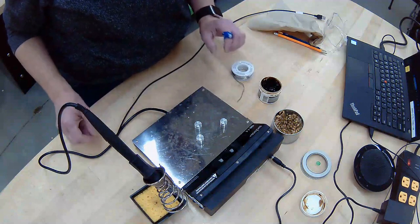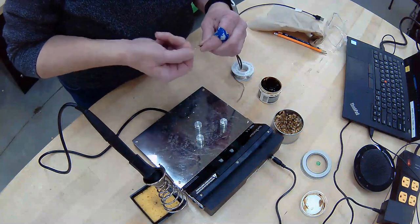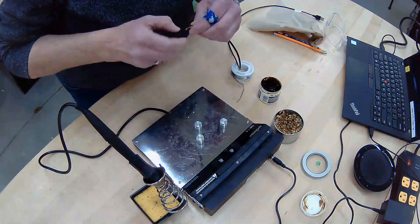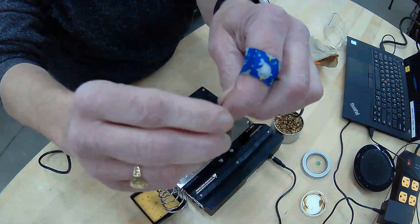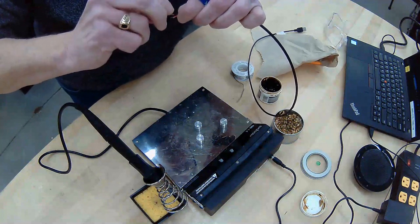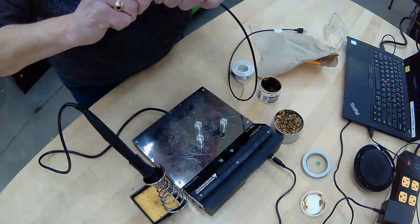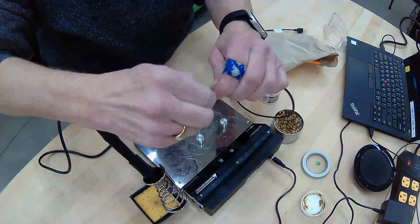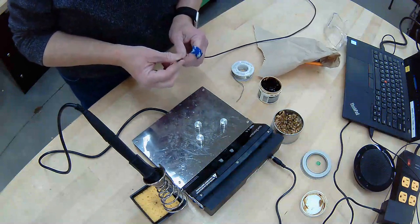All right, so first thing we need to do, we've cut the wires, and now we're going to twist them. We need to twist them together in a really tight bunch. And I usually like to grab the ends and just kind of keep twisting it until all these tiny little wires in here are all one wire. And you do the same thing on the black wire, and you do that on the red wire, keeping those wires apart. Again, we've revealed the metal, the copper inside this, and if these were to touch in our project, then our light won't light. It will just short circuit.